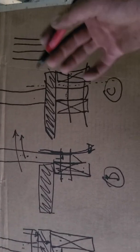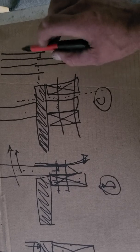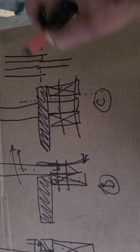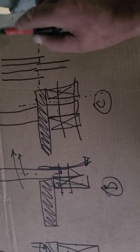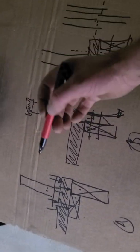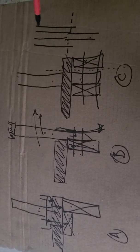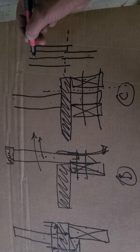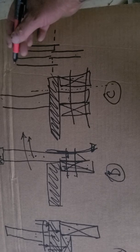It's the same process. I don't like vinyl. A vinyl sleeved post is the same as a composite sleeve post, but I don't like vinyl railing or composite railing. They're weak points, and like I said, if you're on a second story deck and you have toddlers or drunk friends, you don't want your railing to fail on you, because that's going to be a really bad day for everyone. So you can do it that way though.